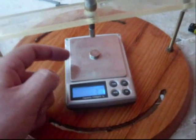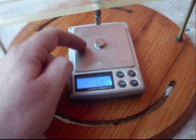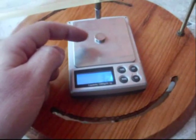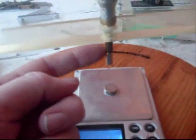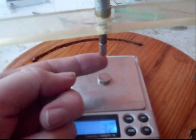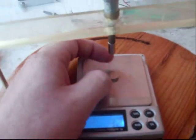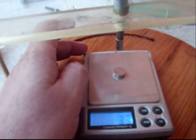As this stands, this won't give you an accurate result, because both of the Neos are on the steel of the plate there. When a Neo or any other magnet is backed by steel, more of its flux is thrown forward, so it's basically stronger with a steel backing plate. The same applies to the bottom of the micrometer, which is forming another steel plate. So what we have to do to make this more accurate is to separate the steel from the magnets with a bit of plastic or similar. What I'll be doing later is probably turning up a few Perspex plugs so that the magnets are nowhere near the steel when we're doing the measuring.